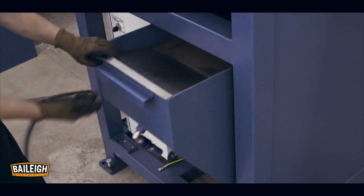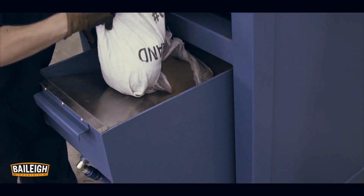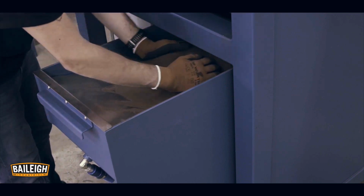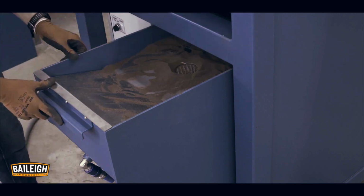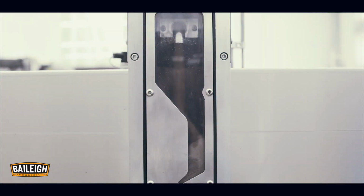Fill garnet hopper by turning off air pressure valve and opening the shutoff valve. As the hopper plug releases, pull hopper out and fill with garnet. Although the machine has a mesh to avoid any unwanted particles, make sure that nothing except garnet is in the hopper tray during filling. Hopper capacity, approximately 150 kilograms.